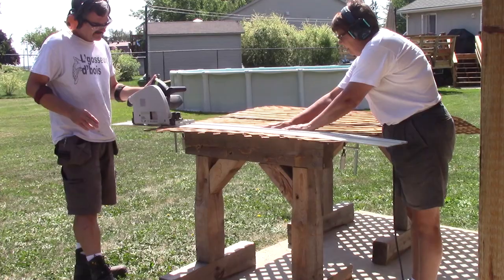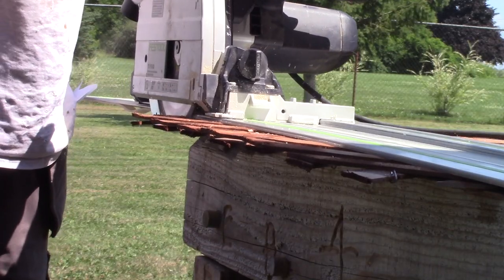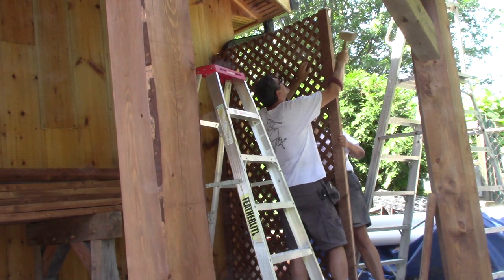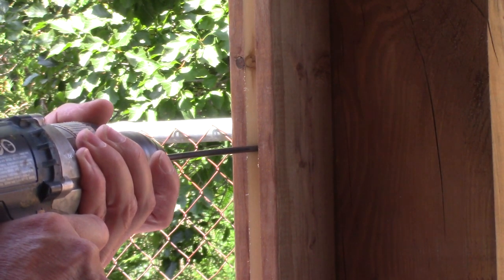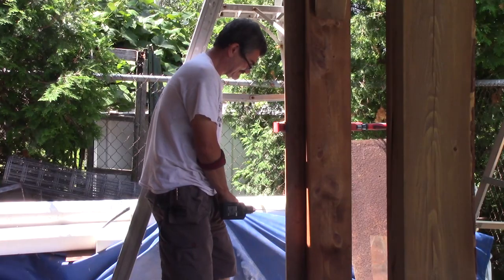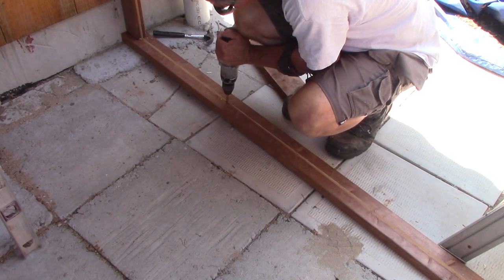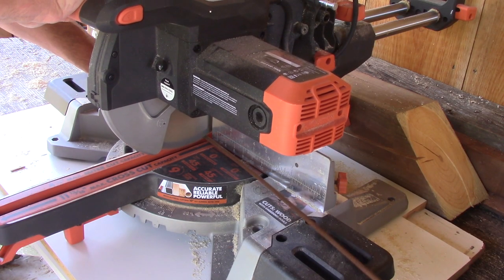And the one between the lattices also. Then we cut the lattices. I tried to check my cut, but I noticed pretty quickly that with nothing fixed in place, it's impossible. I decide to screw everything in place. When both sides are screwed, I drill some holes on the bottom two-by-four between the concrete tiles. To prevent the bottom from moving, I drive some threaded rods in the ground.